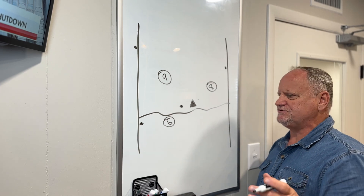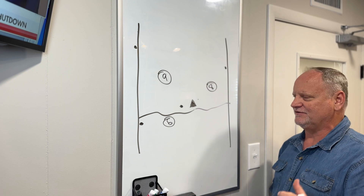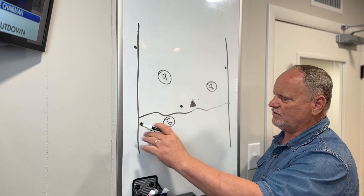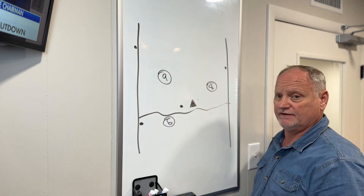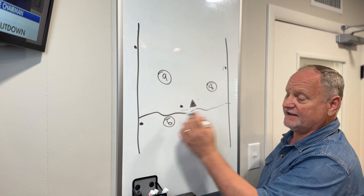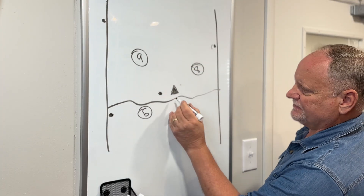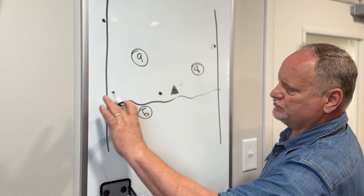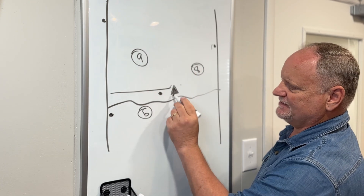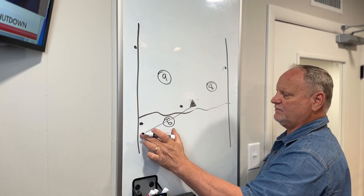You might be thinking: why not use directional antennas and shoot straight to the closest tower? We thought about that — in fact, we were going to do it. But then we thought: what if that one goes out, and the next one goes out too during a storm? We're in hurricane alley. We could have an antenna facing one direction getting signal from a directional antenna, but it won't be able to receive towers in other directions, because those directional antennas have a cone-shaped pattern — anything outside that cone isn't going to be received. So we don't want that.